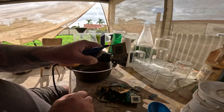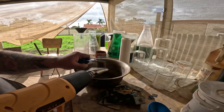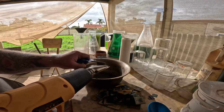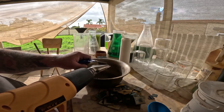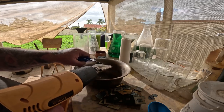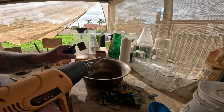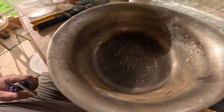Basically, hold them like that, heat them up, and just bang it on the tin and they should all fall off into the tin. Or just wipe it with the tip of the heat gun, wipe them off into the tin. I only just turned the heat gun on and this one takes a while to really get hot. There we go, they're all coming off now. One clean CPU — make sure there's no pins on the machine. I'll turn it off and show you the nice little pins in the tin.